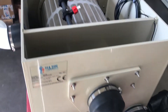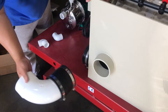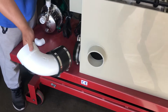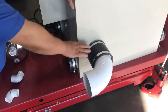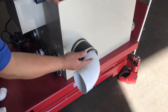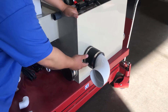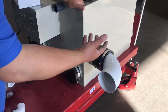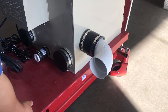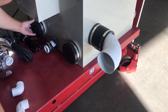Over here is the water outlet for pump-fed. For pump-fed we're going to use these two holes, one on each side — again four inch to four inch. We recommend you do not reduce it, because the water coming out will be faster. If you reduce it, you restrict the water flow and you're going to have a problem. The holes we don't use, we go ahead and cap them off.